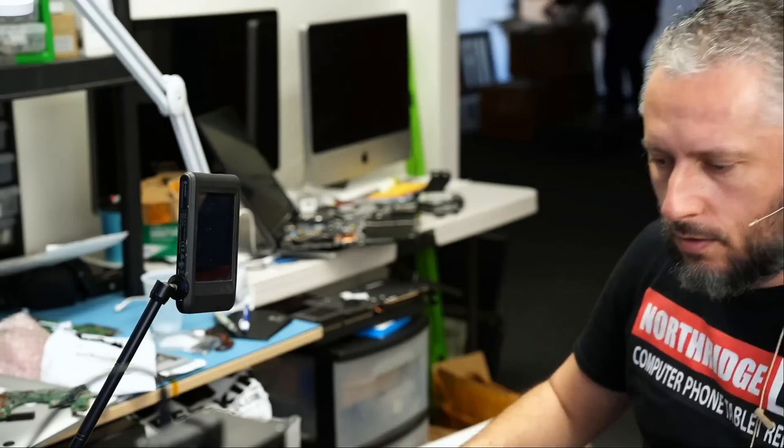Any short circuit on the board — it doesn't matter what that circuit is for, whether it's keyboard backlight or whatever — is going to prevent the laptop from powering on. I just realized I replaced the cap but didn't have the microphone on; a customer came in, I took it off to speak to him, came back and finished. So what does a backlight circuit have to do with a laptop not powering on? Any short circuit anywhere on the board prevents power-on. We replaced the cap and I'm going to hand this over to Big Boss to reassemble and test.